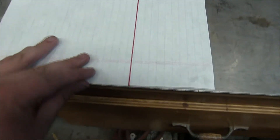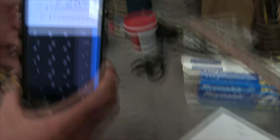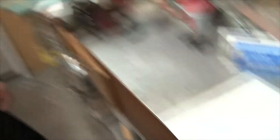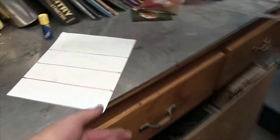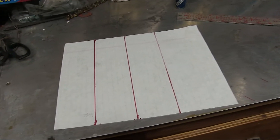It's another day. We've trimmed the fiberglass off the edges with an exacto knife and been sanding it and truing it up. Edges look pretty straight — not perfectly straight, but pretty. What we did was wrap a piece of paper around the tube as tight as we could and mark where the overlap was, so from here to here is the circumference of the tube. Since there are three fins, we divide that by three and make a mark every 2.4 inches and then draw lines down it.